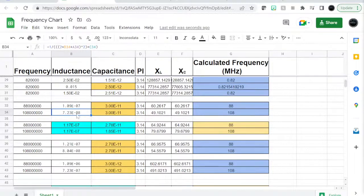In that case I'd be varying my inductance and not my capacitance, but that's not ideal — you want to vary capacitance because it's easier to tune. So fix the value of inductance and find your capacitance. Or if you have a capacitor of a known value — 20, 30, 40, 60, or 70 picofarads — plug it in and calculate the inductance, then wind the inductor to that value.